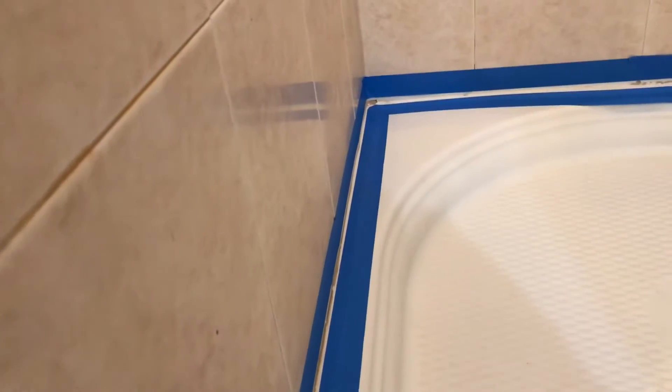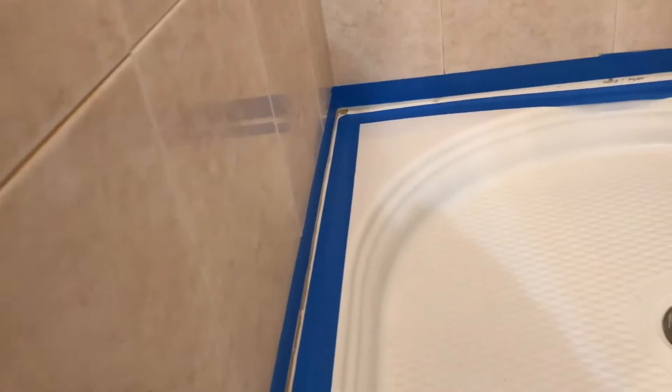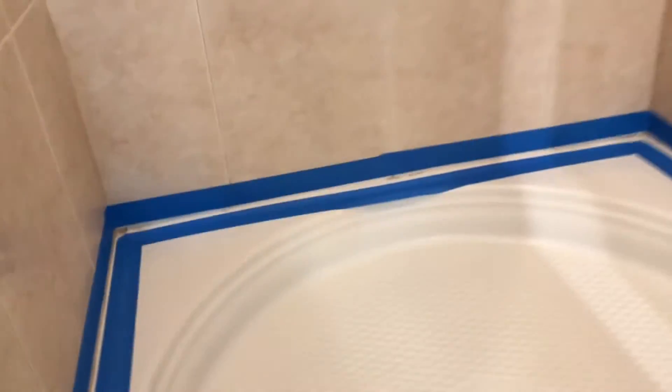What you're gonna do is go around the corners — I didn't show it in the video, but clean all your broken caulk, anything that's in the way. Chip out broken caulk, chipped-up grout, chip it all out, clean it, use a shop vac, clean it all out. Make a nice edge with your tape — you can see the seam I made all the way around.